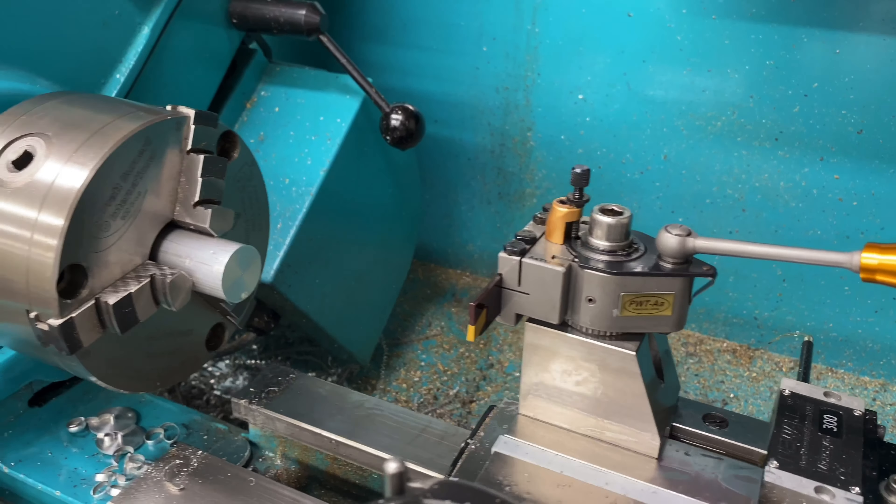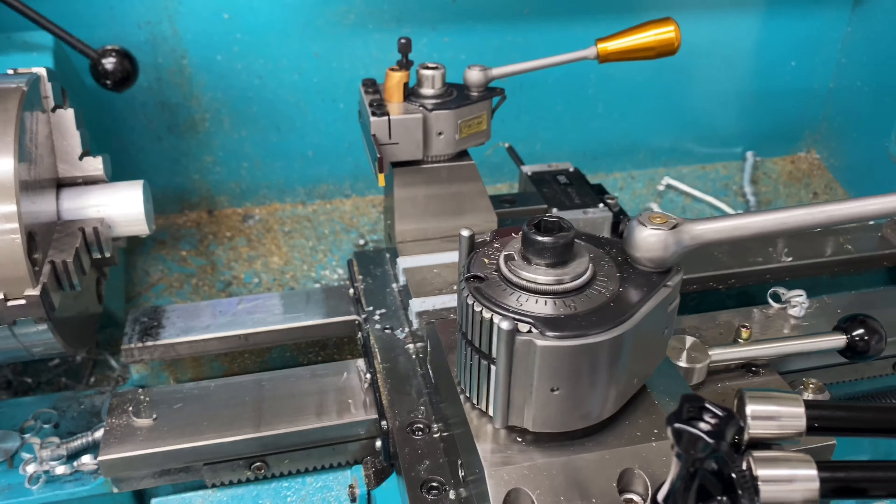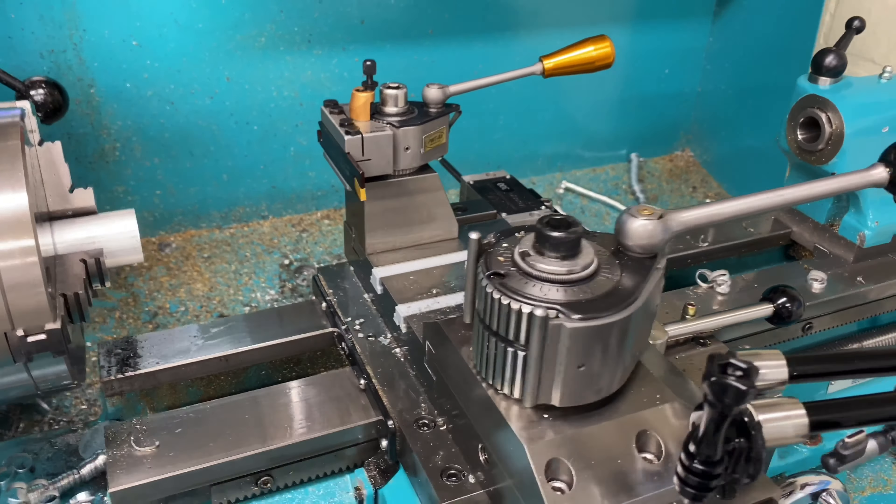On my size A tool post at the front here I generally use a 2mm wide parting blade. The reason being is that the cutting force is less because the tool width is smaller - it's the narrowest parting blade that I have at 2mm, plus there's less material wastage when you're parting off. But the rear tool post I'll probably use for grooving or for undercuts, where I might want a slightly wider undercut on something like a thread - where I might want a bit more than a 2mm wide undercut if I'm single point thread cutting or something like that.